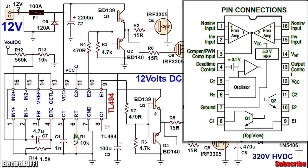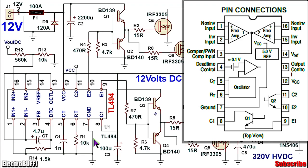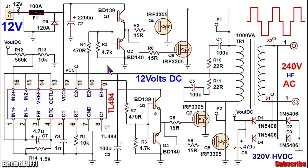Pin 5 is the CT pin — connect a capacitor between pin 5 and ground as shown. Pin 6 is the RT pin — connect the timing resistor across it and ground. The timing capacitor C1 and resistor R1 are 1nF and 10kΩ respectively, and with these two they set the oscillator frequency to about 100kHz, but the outputs at the output transistors will be half of that giving you 50,000Hz. Pin 7 is ground — both power ground and logic ground. Pull up pin 8 and 11 to VCC of 12V and connect a small capacitor between VCC and ground to smooth the voltage applied to the IC.